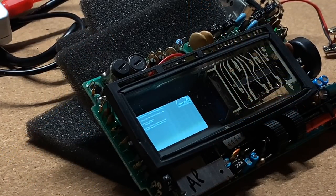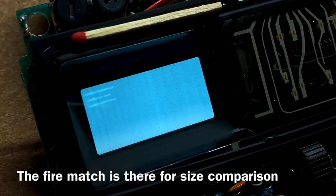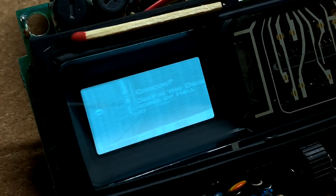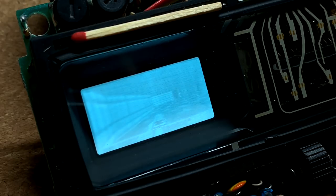Here's another video shot where you can see the screen a little bit better. The whole project turned out to be a little more complex than I thought, especially getting the audio running on the TV set. Those setups with HF modulators are very sensitive to noise in the circuit, so it took quite a while with shielded cables and short connections to get the proper image. Nevertheless, I had a lot of fun playing around with this little TV and bringing it back to life. I hope you liked the video — if so, please subscribe and give it a thumbs up. Thank you very much for watching and see you next time.